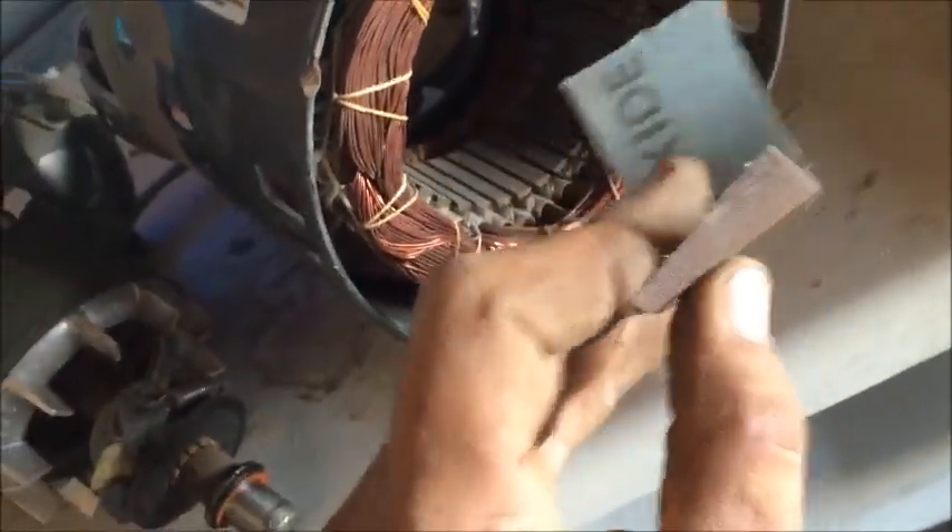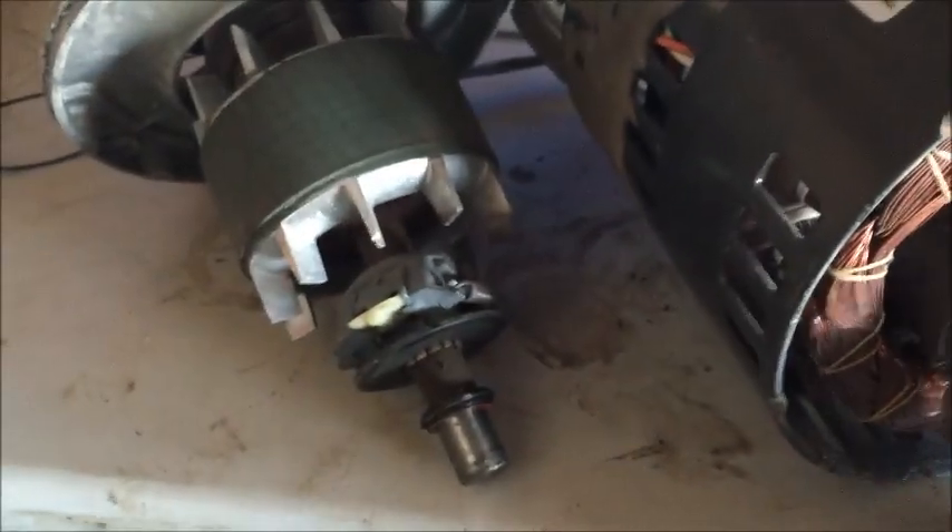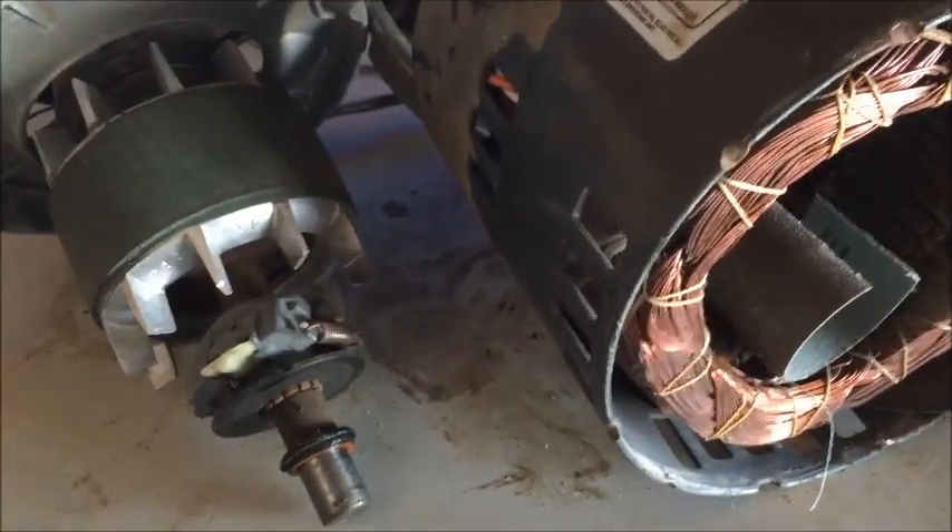For those who need to know, I've opened up the case and you can see the armature — see that little bit of rust right there? That brown stuff is what's causing it to heat up; there's a bunch of it down in here. I'm going to take a piece of emery cloth and clean it. There are grooves on the armature going in this direction and I've already started sanding — you can see where it's clear. I want to stay with those grooves when I sand, going back and forth like this, not up and down. Just clean it up really good and that'll keep it from overheating.